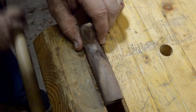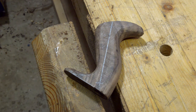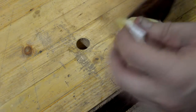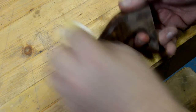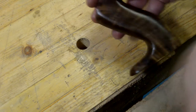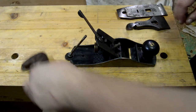Once I've got it all roughed out, the next thing I'm going to do is put a little bit of finish on it — this is after I've sanded to 400. The finish that I'm using is just boiled linseed oil. I like my handles, whether it's plane handles or hammer handles, I like the feel of boiled linseed oil and no other finish on the handle. Look at that beautiful grain in the walnut.